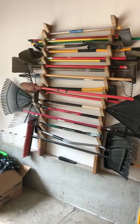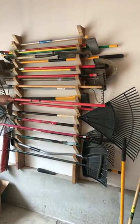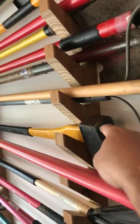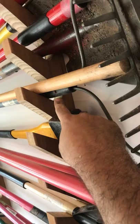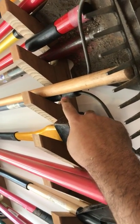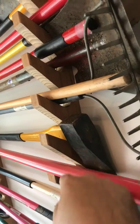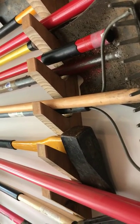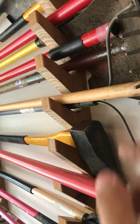It's much easier for me to get to. All I did is take some six-foot-long two-by-sixes, went about two inches in, and drilled an inch-and-a-half hole. Two inches in, inch-and-a-half hole, and I did every four-and-a-half or five inches. I'd recommend going every six inches — if I were to do it again, I'd go every six inches. So two inches in from the back, and then space them every six inches.